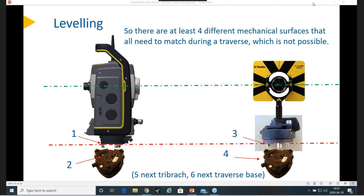Back to the earlier question about the 0.001 millimeters in the instrument base — just checking the math: is it 60 seconds of deviation and not 6 seconds? Yes, it's 60. It depends on how you calculate based on the radius and your height up to the instrument. These figures have been verified with our engineers, so I'm fairly comfortable with them. But let us know if you have any questions and we can tell you how to calculate it.